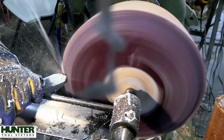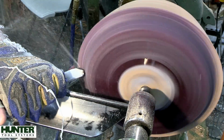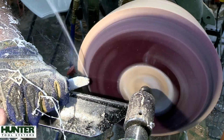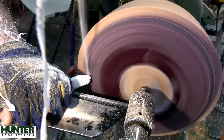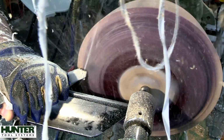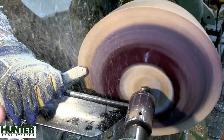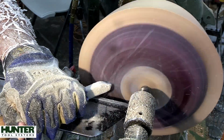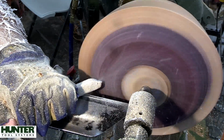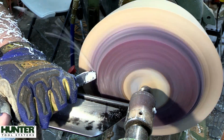As you watch me whittle this down, I will say that even though this resin is fully cured, I am getting ribbons off of it. And until you can get it flattened, you're going to get lots of chip out. But if you're getting chip out after things have been flattened, you really need to look at your technique. Maybe you're being too aggressive, pushing too hard. Once that resin gets trimmed down where it's a flat surface, you should get nothing but shavings coming off of it.